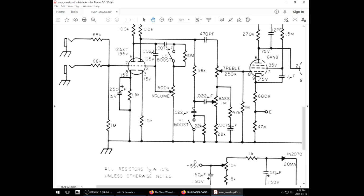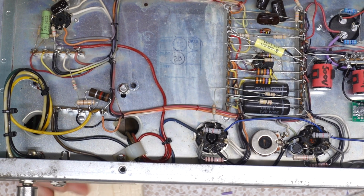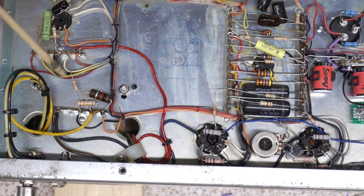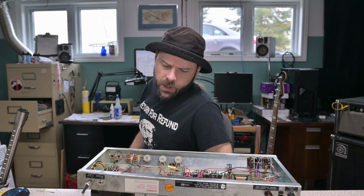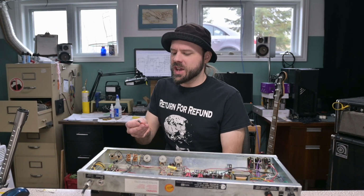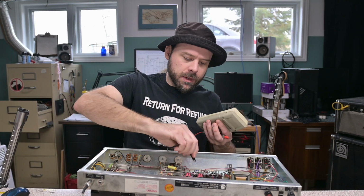So, one of the other things that I noticed, and we'll try this first, is in the preamp section, we have a 250uF 50 volt bypass capacitor on the very first stage. Now, if we look at this amplifier, if I'm reading this schematic right, that's the first stage's cathode right there, hooked up to this guy. Well, yeah, pin 8, input pin 3. There's no bypass capacitor. Why not? Why did they omit that from this design? Oh, 15 volt, 250uF 15 volt. I have a 220uF 16 volt. Let's tack a bypass cap on there and see what happens, bud.